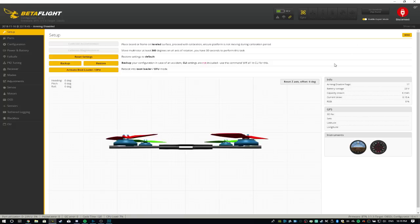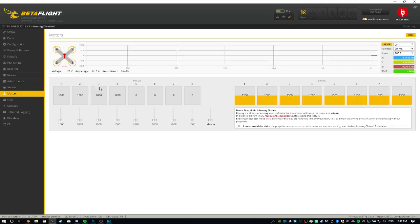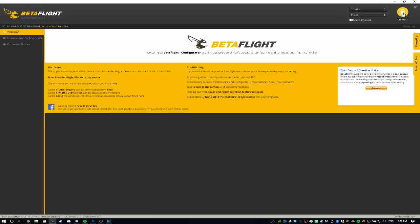You're being stream bummed on Botsy's stream again? Let's see. Motors. Okay, one is good, two is good, three is good, four is good. Cool. All motor directions are working, VTX is working, receiver is working, modes are set. That is a hover test if I ever heard one.